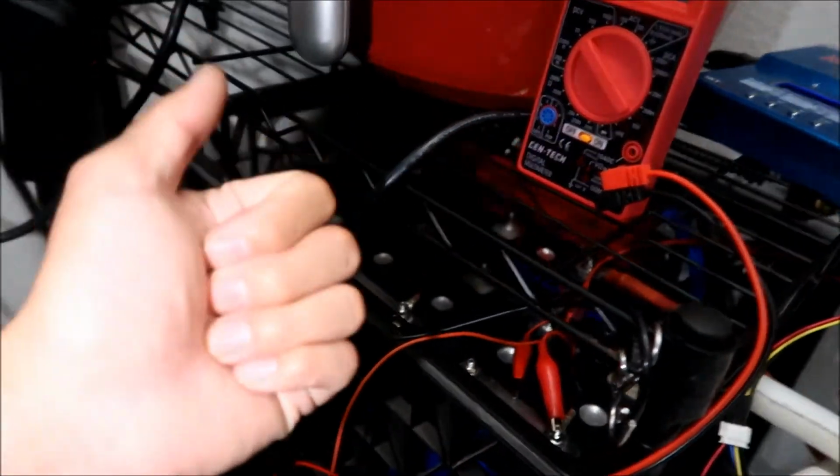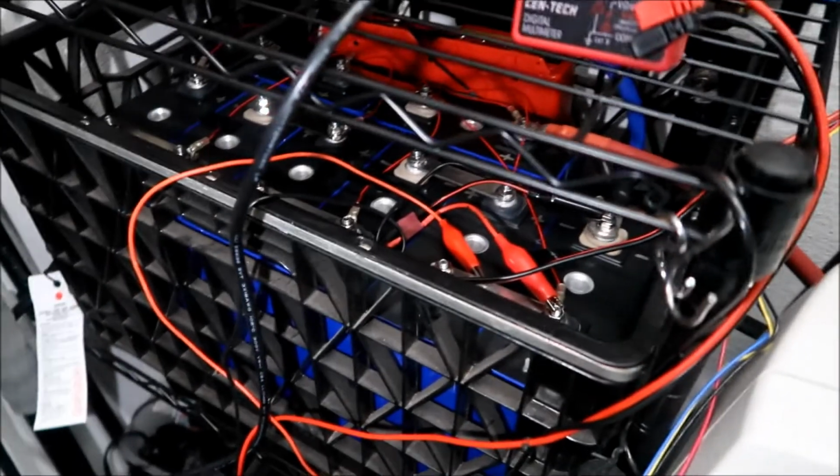All right, here's my go. Hey, it's me here. It's Sunday. Oh, it's Monday. It's not Sunday. It was Sunday, but now it's Monday. So it's been almost a week that I've been trying to balance the battery every night. I try to do it in the daytime a little bit if I know that cell is low, but you can't do it when the battery's got charge in it. If you're gonna bottom balance, you gotta do it at a low state of charge.